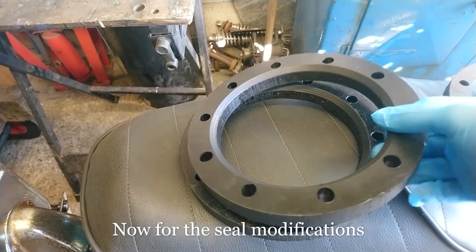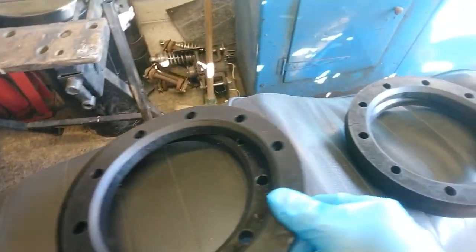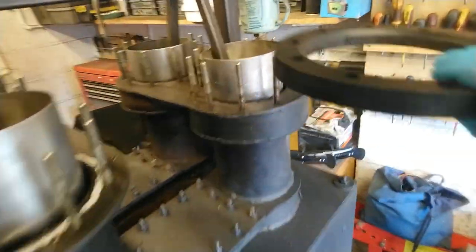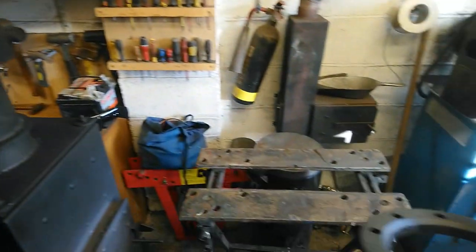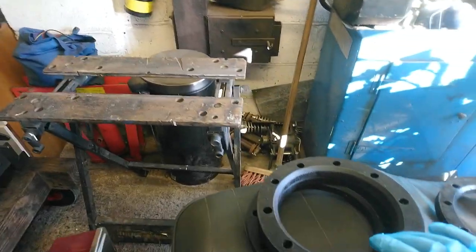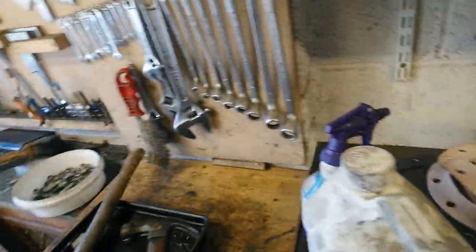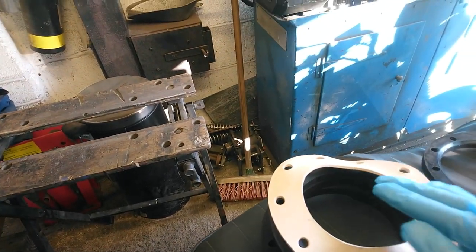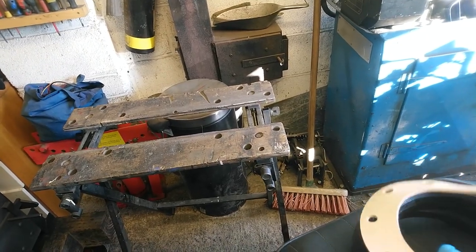On the foundation rings, I've actually put a chamfer on the inside edge on each one. These rings fit the bottom, so they're the bottom ring. The idea of the chamfer is to allow the lever so that the seal will be bent down that way — just to give clearance for the seal to bend down.